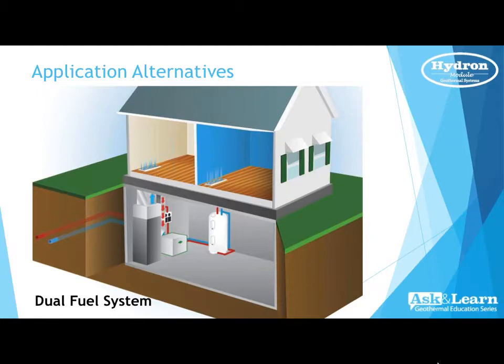So obviously with a split, you can have them sitting indoor like we see here, and then with the outdoor, that same box there that you see in between the furnace and the hot water unit will actually sit outside. So if you don't have much room inside the house, the geothermal heat pump section can actually sit outside and can even be covered up. It doesn't need any air source, or you can build a deck around it or do whatever you want. Absolutely.